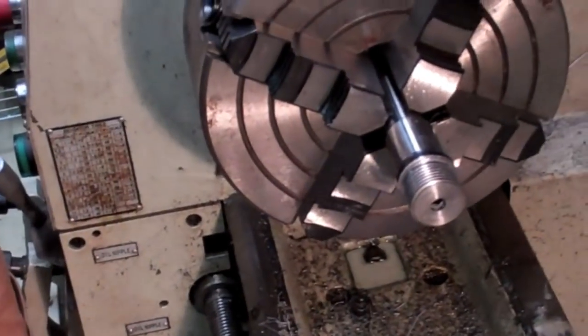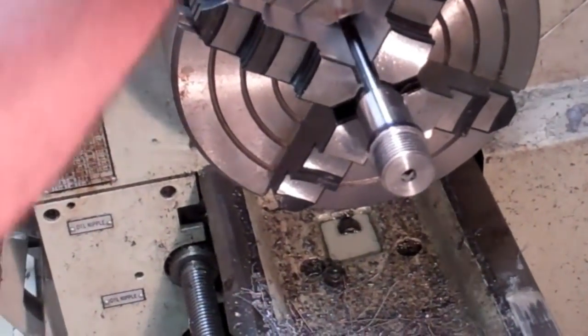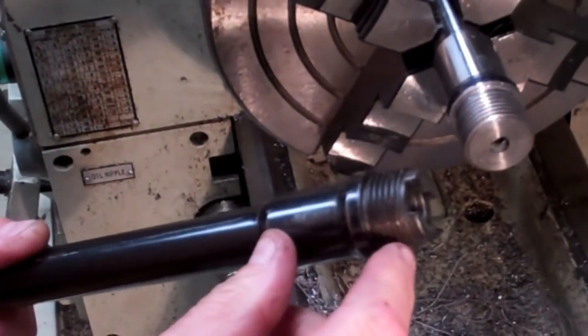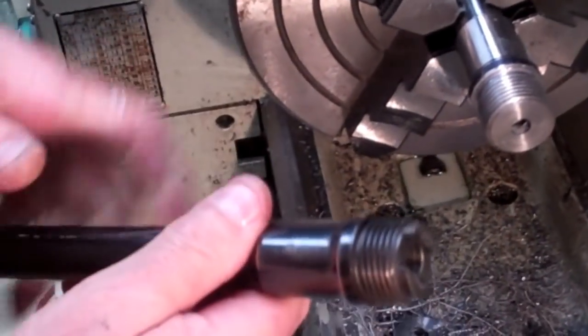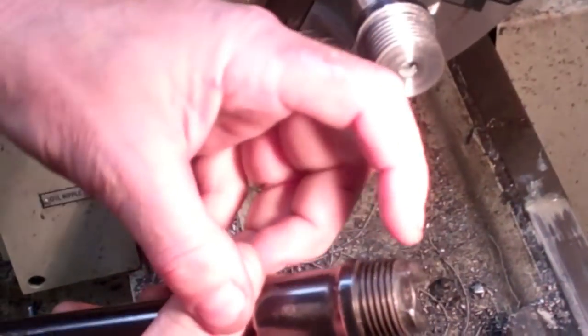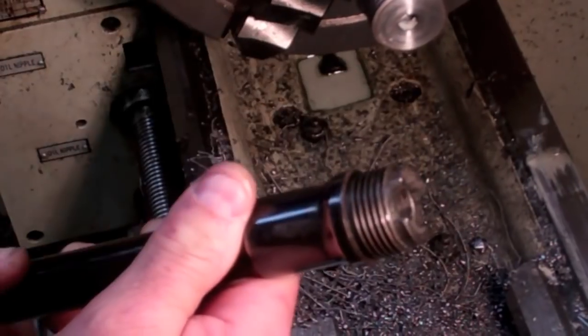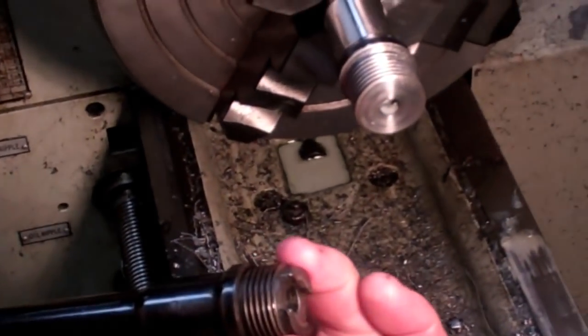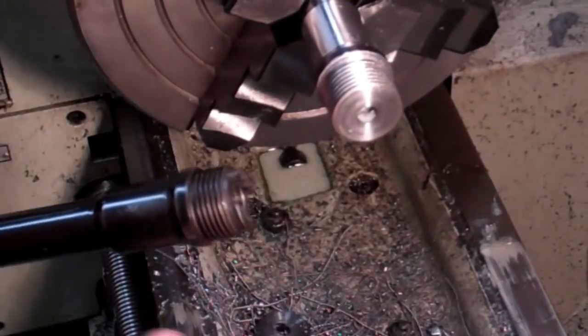One last thing we're going to have to do — you've got your major diameter and minor diameter of the threads, but you'll notice that the inside right here, this little shank, is just a little bit thinner. So we're going to have to get this part right here thinned down, turned with the lathe down to this diameter, so she'll slide all the way into place where it's supposed to go. I didn't explain how to get your major and minor dimensions on your thread depth.